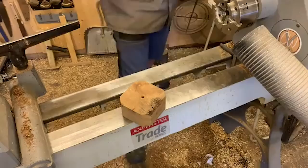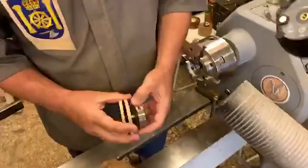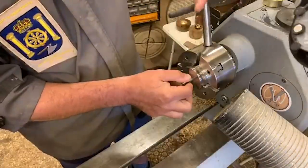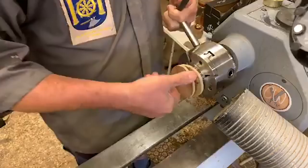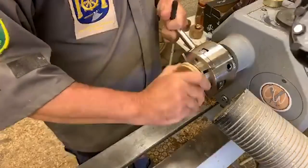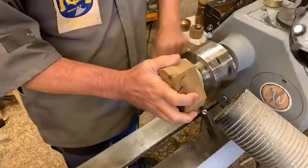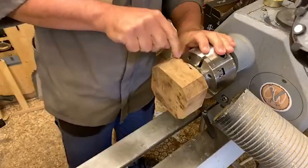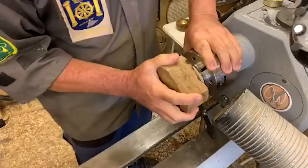Right, so the traditional screw chuck fits into the C jaws. I've got my chuck on there with the C jaws — two packing pieces because the screw is a little bit too deep. The hole I've drilled in the piece of timber is 8 millimeters. We screw that all the way on. I'm thinking I'll keep the natural burr edge — the grain matches the movement in that area, so I think I'll keep it.